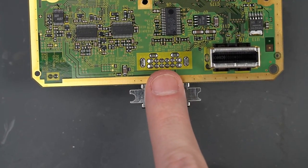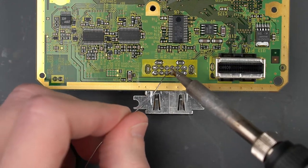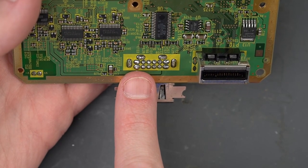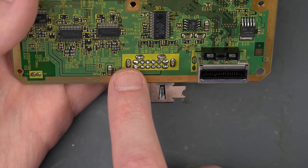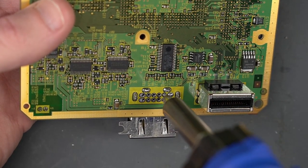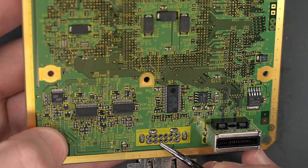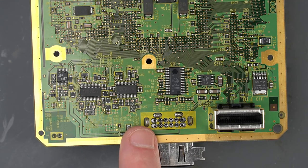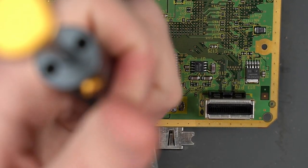Our next goal is to remove this analog port. First thing I'm going to do is add some solder. Dan uses a heat gun to remove this, but I'm going to use my desoldering gun to desolder the pins in the middle, and then I'll use some solder wick to wick the solder from the four remaining ground legs. I'll use my tweezers to make sure those pins are all the way desoldered. I also have a solder sucker with a silicone tip that might be big enough to fit over these pins, so let's try that first with some flux added to get the pads heated up.